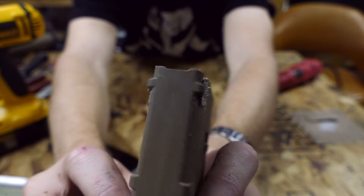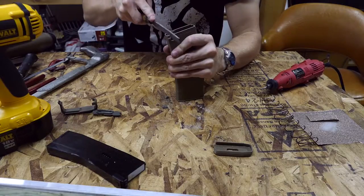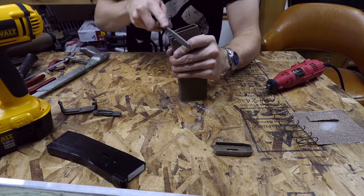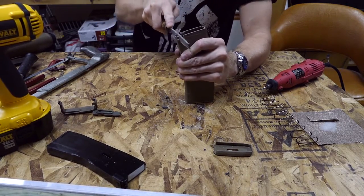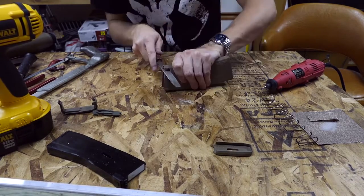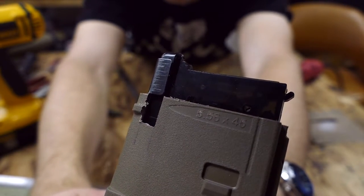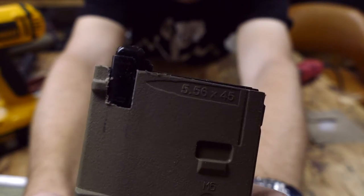You can see here this is the rough cut that you get after you use the Dremel. Obviously we're going to want to clean that up with a file. So basically you can see we're just using a file to go through and square off the corners, as well as make everything nice and neat looking and less jagged and rough. Make sure to do the front and rear portions of the cuts as well as the bottom. When doing a test fit I noticed the internal didn't quite seat all the way in, so I used the file to remove some more material off of the front of the cut.